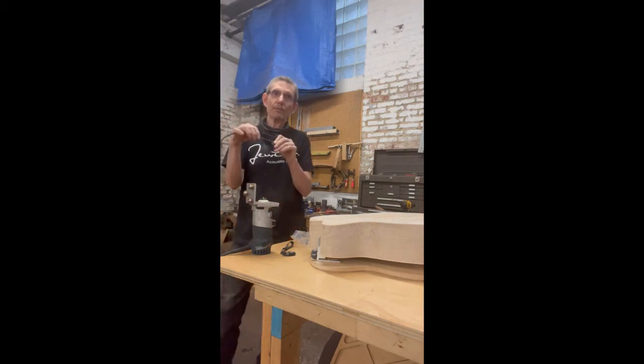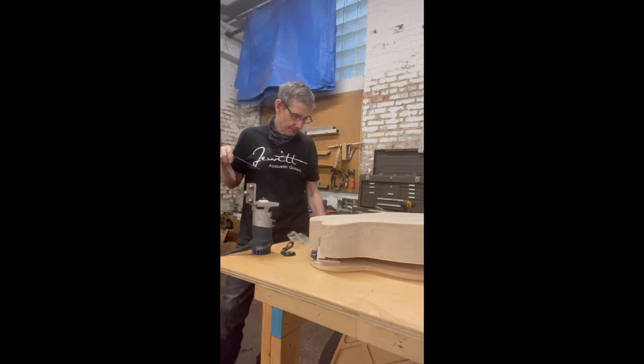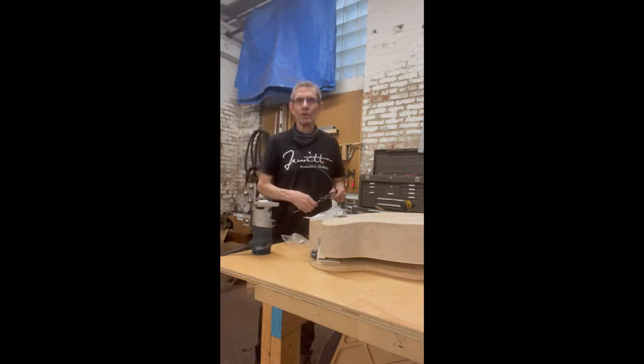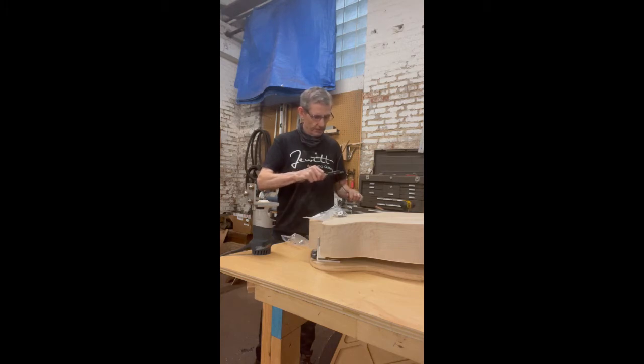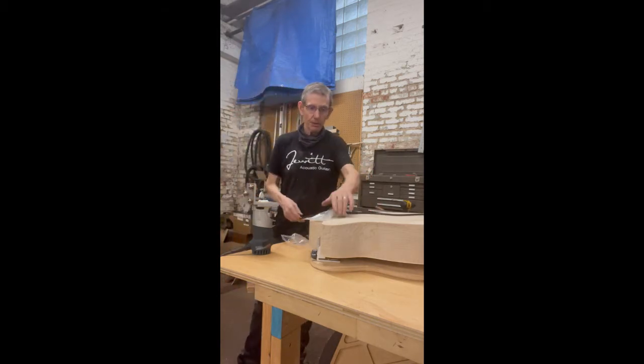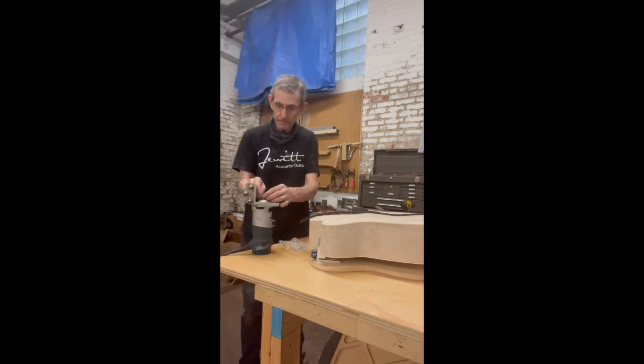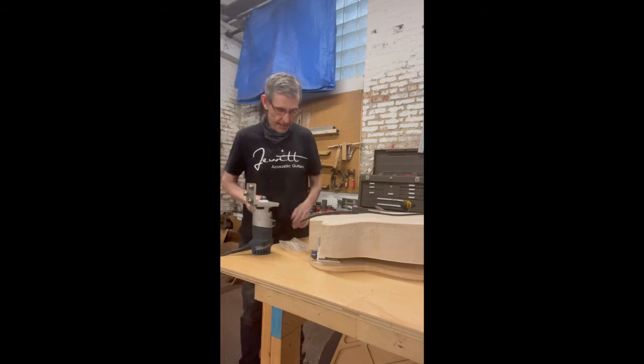The bearing that I need for this, I'll determine by taking the width of the binding, measuring it, and then picking out the right bearing for it. So to do that, I need some calipers. So the binding is coming in at a pretty consistent 0.080 or a little bit less. So what that means is you need to choose the correct bearing so that you're cutting a depth of a little bit less or higher to 0.080. And I'll talk about that in just a sec.